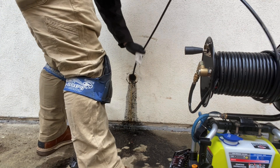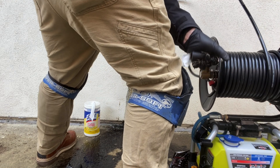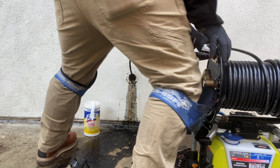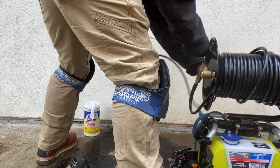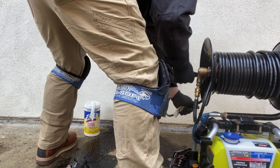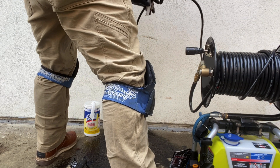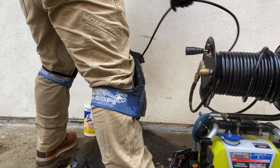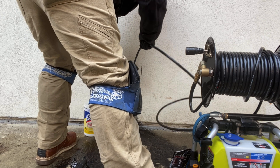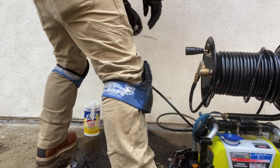That's what I did here at this job after I was done. I'm actually going to keep this little Ryobi pressure washer and put a little quarter inch hose on it with a carry-around reel, just to be able to hook it up to the pressure washer. It's actually really quiet and it works really well. I don't think I could really properly clean a line with this pressure washer converted into a jetter, but this coupled with the flex shaft and my cable machines and everything else I have — I can for sure clean a line.